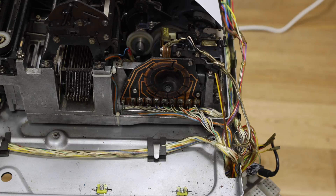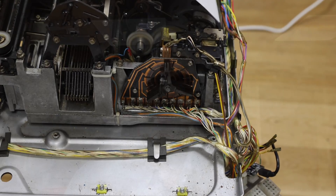As you can see it's quite noisy. We have a simple electrical circuit that comes in from the back, goes through the common on the keyboard, through that brake connection, into a connector bar at the back of those eight sprung wires — a combination of which is set by key. Those then go to the distributor which connects to each in turn. So you have a circuit that's normally closed and it opens for a start bit, then closes and opens in a pattern for the eight data bits as you send out the byte. It happens ten revolutions a second — eleven bits: a start, eight data and two stop — so that's 110 baud. That is how it sends data. It is completely mechanical, no electronics at all, just contact wires and brushes running off a motor.